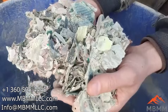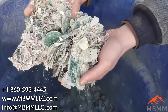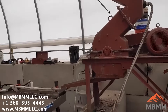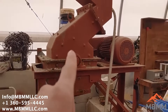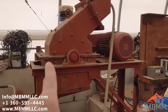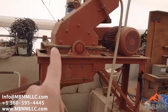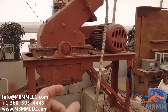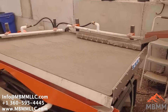So we're going to save everything. Anything that's not magnetic is going to come up here and we'll catch it in this garbage can, then take it over and run our sample on our shaker table. Let's take a little walk through our system here. This is what we call our small turnkey PCB system. This is a 16 inch by 12 inch hammer mill. It's got a rotor on this shaft here that spins around in this case, with a bunch of hammers attached to the rotor that beat anything that goes down the chute. It comes down this chute onto one of our four foot by eight foot shaker tables.